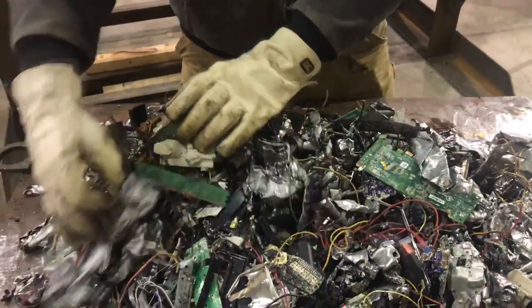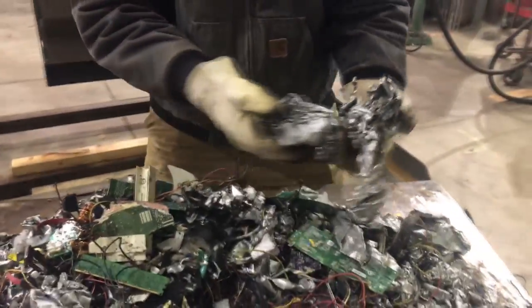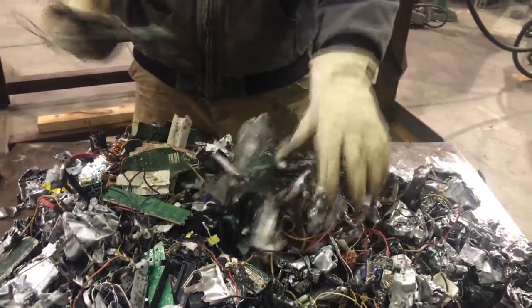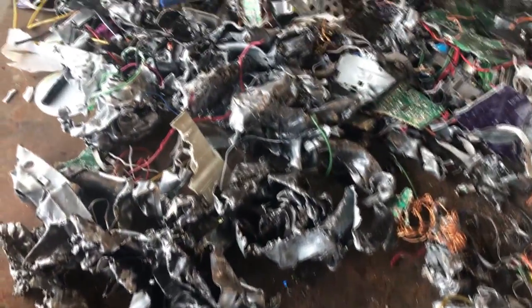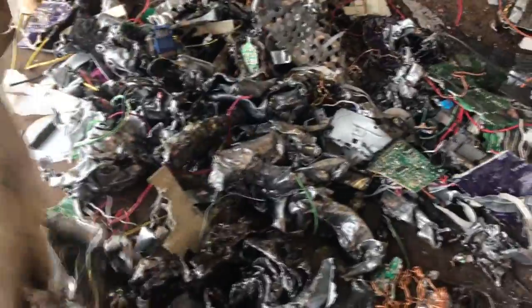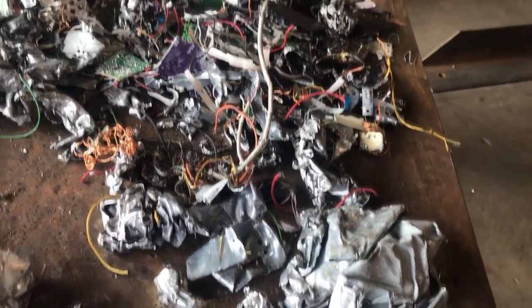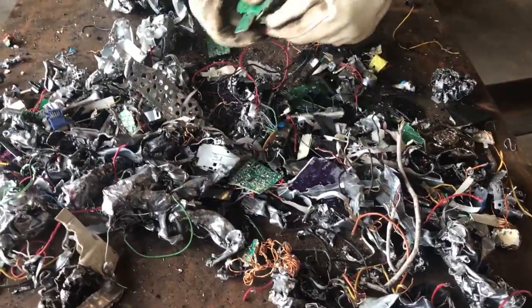So here's those PC towers — all the steel came out really pretty clean and then you've got all the pieces of boards and small wires and stuff, so that broke them up pretty good. Surprisingly, all the casing material and steel around the power supplies came out nice and clean. Get it out with the mag separator — there's probably some hand picking to be done but it really separates all the different components quite well.